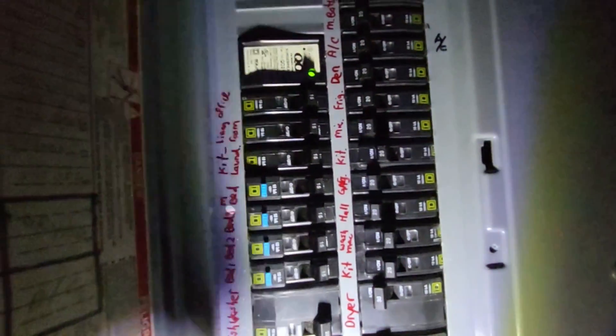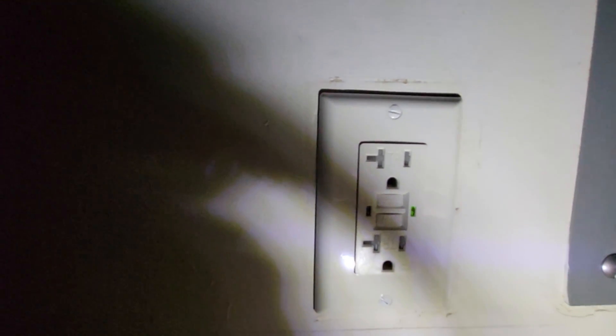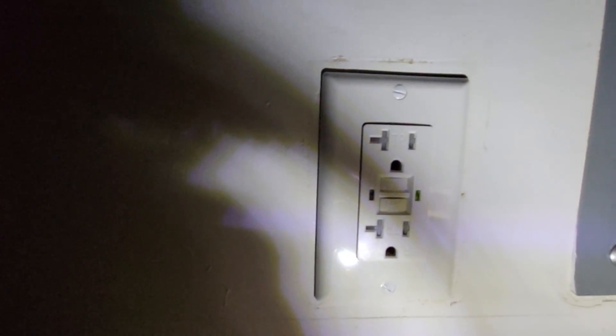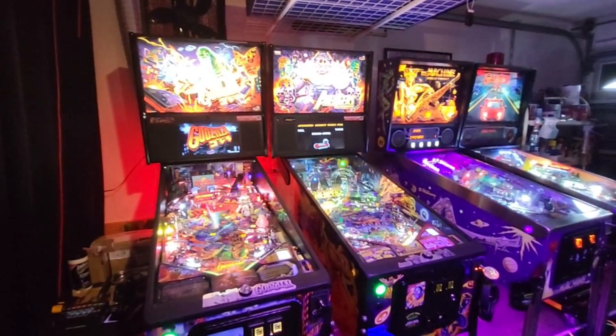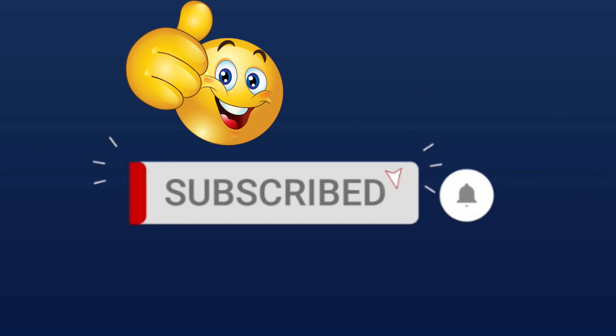Make sure everything's snug, then turn on the breaker. It's not popping — that's good. Press the test button — green light, it's good. There are plastic inserts in the holes, so it's basically child-proof — nothing's foolproof, but you have to sometimes wiggle it in because the plastic inserts are kind of stiff. I'm going to turn on this outlet and surge protector strip. I've got four pinball machines plugged in and everything's working. If this video was informative, give me a thumbs up, subscribe, and hit the bell notification to stay updated on the latest tech videos. Thanks for watching.